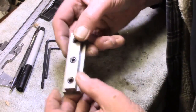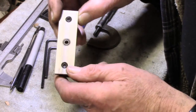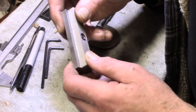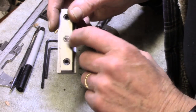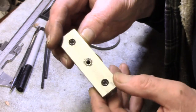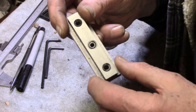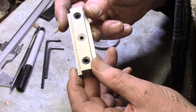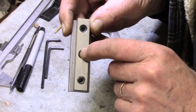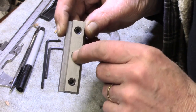I didn't want to bore everybody with the boring — as I think I said, it only needed a small enlargement, about 25 to 30 thou I think. So I got these two small bearings in, which you can probably see fairly clearly. They're both inset by four or five thou for good clearance. Now I've got to make a spindle or shaft, whatever you want to call it, which is five millimetre for that.